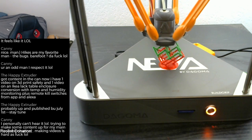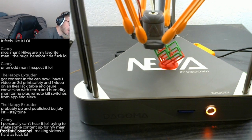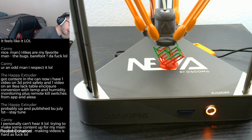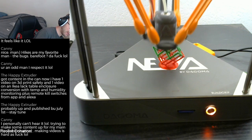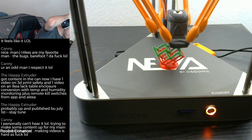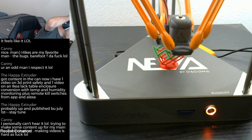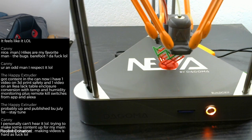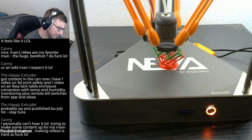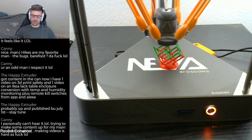Though, I will say that the color exchange worked very well. The cube didn't turn out all that great, I'm not gonna lie. I think the retraction settings need to be better. Maybe it needs to be printing a little bit slower. And I think a layer cooling fan would probably help, since it is PLA. But it should be interesting to print this on all my printers, see which one actually performs the best. I feel like the Anet A8 would probably print this the best.